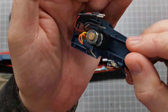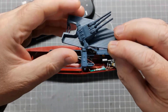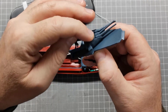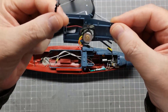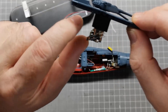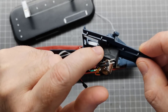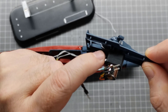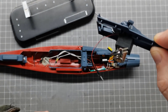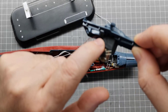Looking at this more closely: there are four leads that go to the stepper motor, basically controlling the poles in the motor. There's also the LED lead which pokes out the back and gets caught when it tries to go the other way. Previously when I showed the stepper motor, you would have seen the gearbox naked — these do come with a shield to keep dust out. I hadn't put it on previously because it's easier to troubleshoot if I can see which way the motor's turning, but now I know it turns the right way I can put the shroud on.